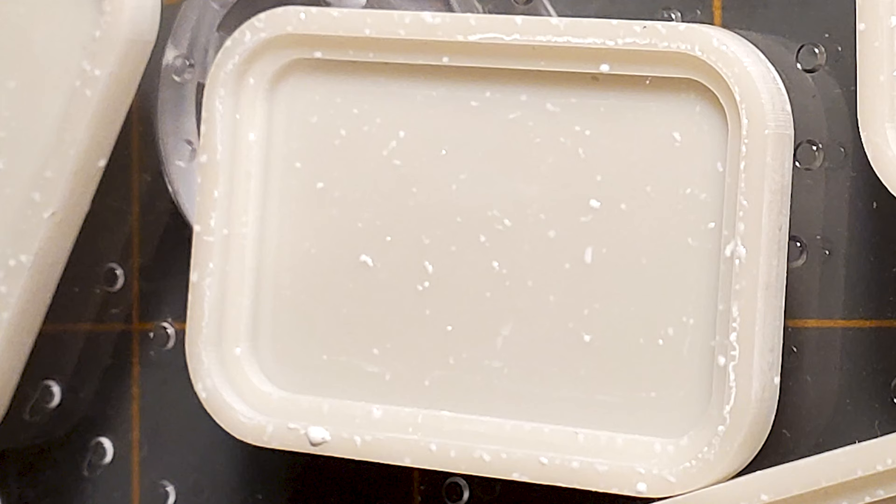Like many of you, I have seen a number of people who have tried things from coffee filters to distilling the IPA to vacuum processes and it all seems to work okay. But the process that seems to work well for everyone is decanting your IPA. But the problem with that process is that it can take weeks for all of those resin particles to settle in the IPA. And if you're not filtering your IPA, you may have seen these white flakes show up on your prints. I know I struggled with this myself early on.